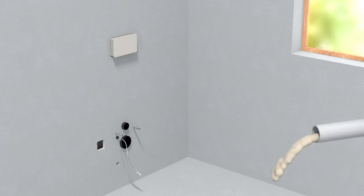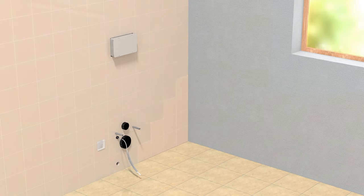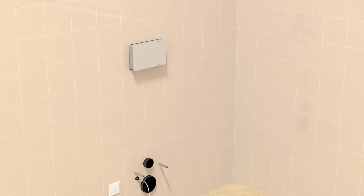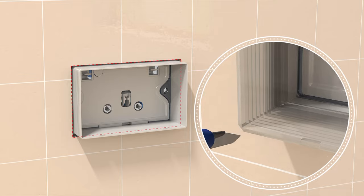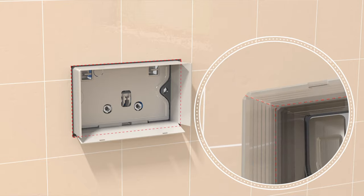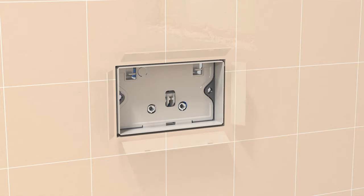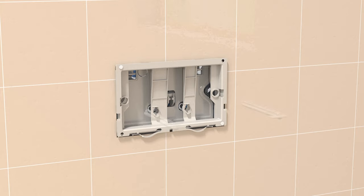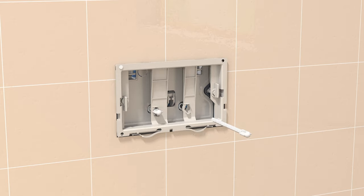The rough-in phase is now complete. Now complete the finished wall and floor. Remove the push plate cover and cut the exposed section to the finished wall. Fold the pieces to break them away. Install the push plate receiver, then install the push plate panel.